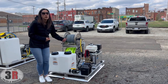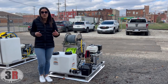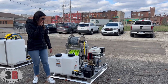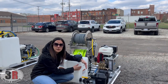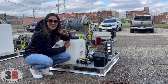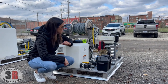The plumbing on the back is where we connect to the external water tank. This particular customer is getting a 325-gallon water tank. You can connect to whatever size you need, or if you've already got a tank on your system, it's a perfect way to tie into an existing water tank. There's a three-way ball valve that's how we pull from either the winterizing system or from the water tank. And then we've got a filter before it goes into the pressure washer — we always want to make sure the water is completely filtered so no sediment or debris gets into the pump.